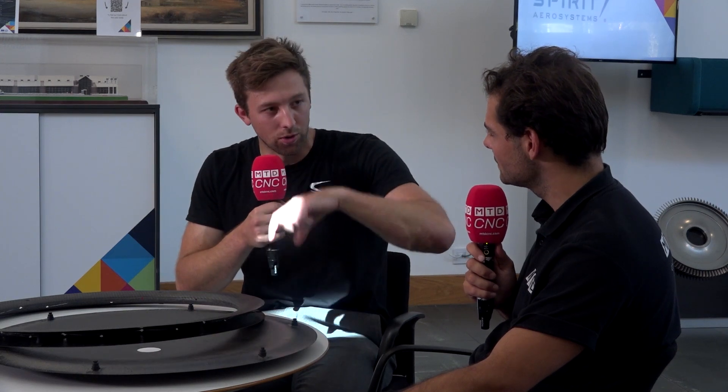Did Quick Grind have the expertise in composite machining that you needed? From Quick Grind's perspective, they've seen a lot of this before — all sorts of projects. For the tooling side, they were a hundred percent on it in terms of what tools are best suited for this sort of job. Some ideas they gave me also helped extend tool life — for example, when cutting around the external perimeter, moving the tool height-wise in the Z-axis to use up all of the carbide all the way down the tool, rather than wearing out just one blunt section. You're using more of the tool and getting longer tool life.